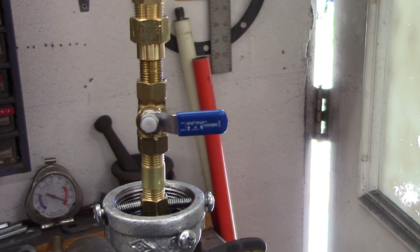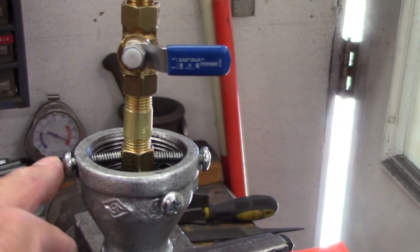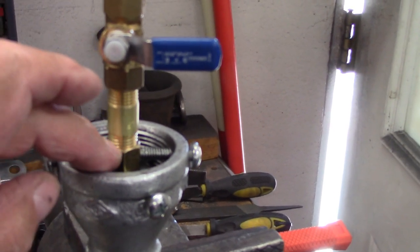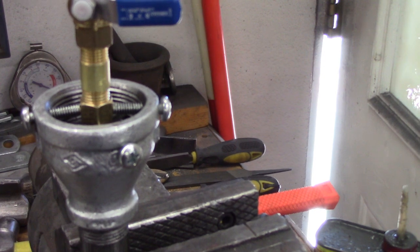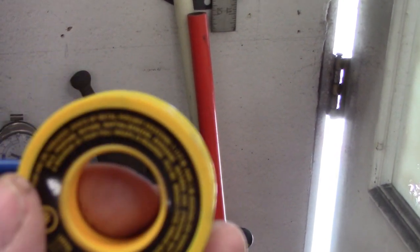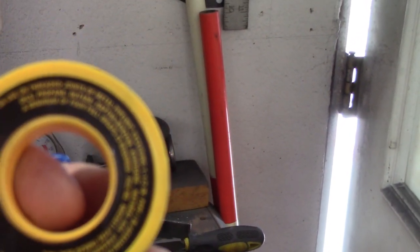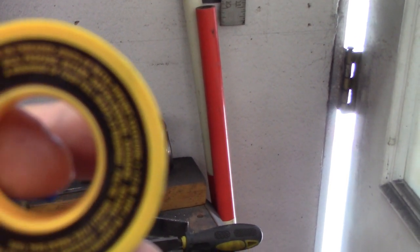So this is how we ended up. I've got these screws in the bottom here - there's four. I had to do four and they're kind of offset because this is a six-sided coupling - it's not round. So it created a little havoc but it came out good. Next we're going to put this whole brass assembly together. And when I do, I'm going to use this Teflon tape. Notice it's yellow - it's set up for gases, propanes and whatnot. The other white Teflon tape isn't good for this kind of work. So whatever you do, you probably don't even need it on the brass, but I'm going to put it on everything just to be safe.